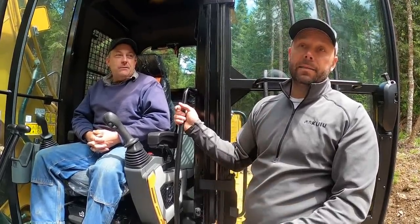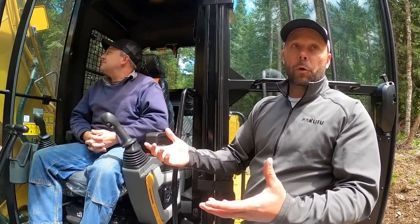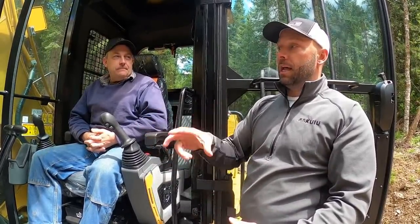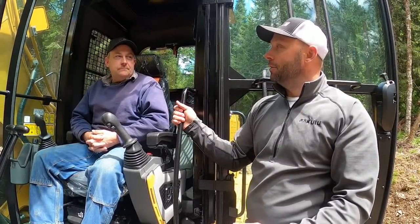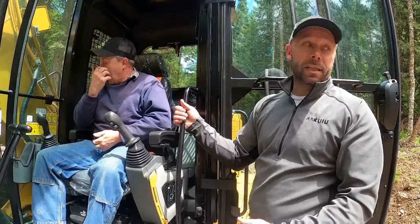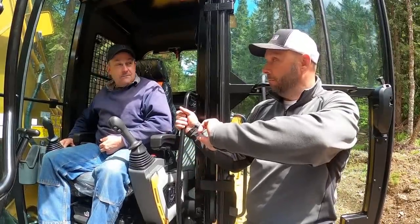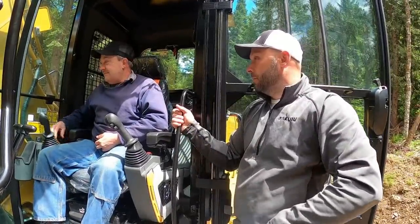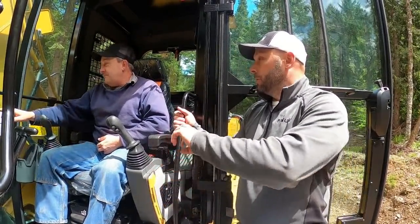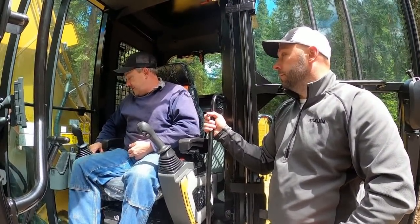The idea behind this is to kind of give you some sort of a Swiss Army knife. If you're going to be off on your own and changing a lot of attachments, that's that 12 minute idle, really? Shut down. That's good. So it basically said 12 minutes, our regeneration system, we don't want to create no more soot. We're going to shut down. And then we rotate. Yep. Say no. And then rotate her back over. Just go ahead and rotate her back over. She turned green. Yep. Start her back up.